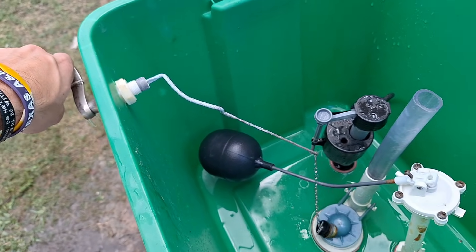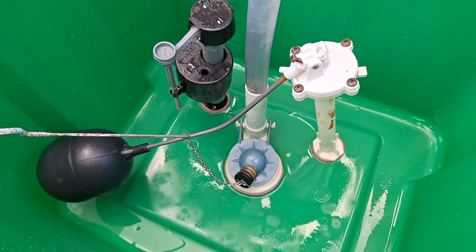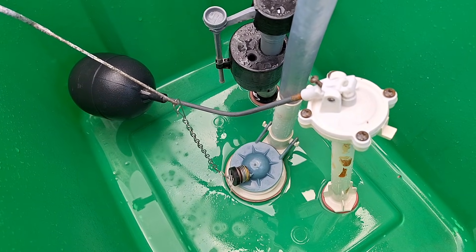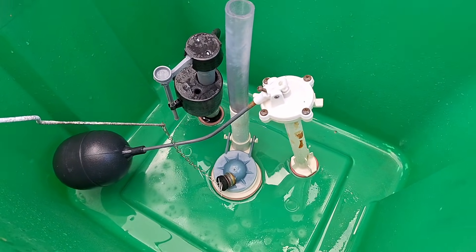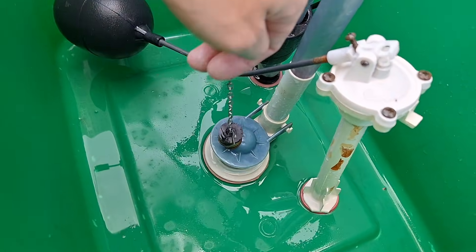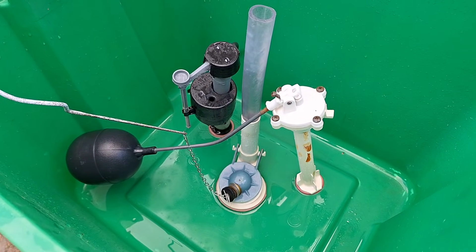A metal rod handle is important because it takes a lot of force to lift this flapper with 18 gallons of water on top of it. You also want a flapper that is fairly stiff, because if you go out and buy a new flapper from the store it will actually get sucked down into the flush valve and you'll have to manually reach in and pull it back out. You want a hard-frame flapper — not rubbery. Also make sure it is a water-saver flapper, otherwise it will get stuck open and drain the entire tank.